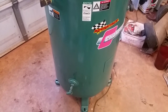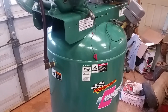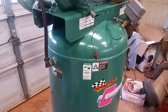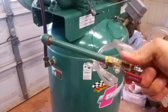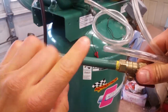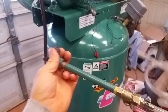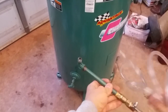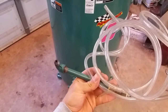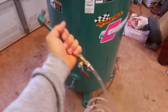There's also this right here — that's my little auto drain thing; I'm going to Teflon that up. And then the bottom drain. Here's my bottom drain with a little blow-off valve on it. I was having a heck of a time finding the PSI rating for black iron pipe, so if y'all know, leave a comment below please. This is going to screw into the bottom like that, and this pipe is going to run out of the garage door so it'll blast all the moisture out of the bottom.